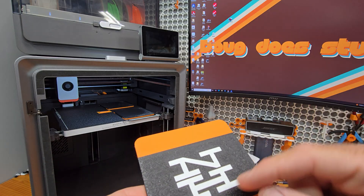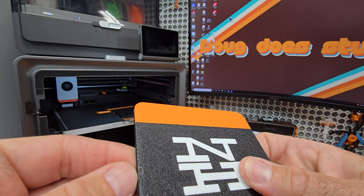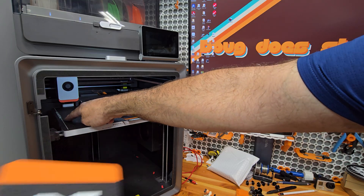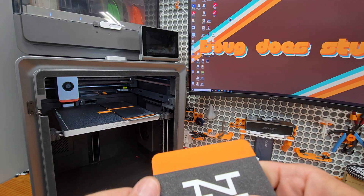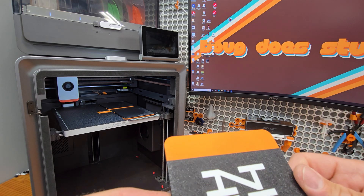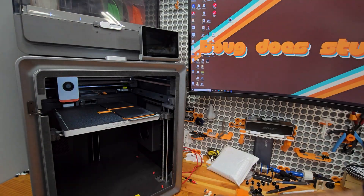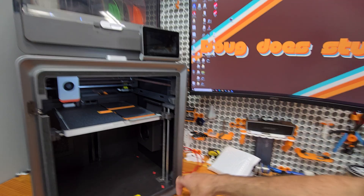You can see the Z is starting to get a little funky. On your plate where it says double-sided PEI plate, if you print over the top of that text, it picks it up. Well, that's really funny, but Z problems over here. See the line showing? So that's not sellable. Thanks very much, Anycubic. That's 40 cents down the drain.